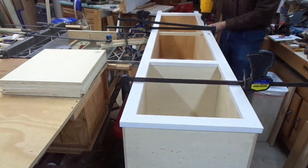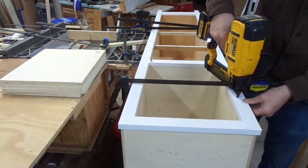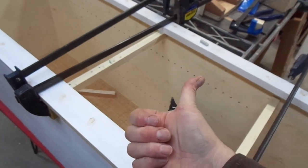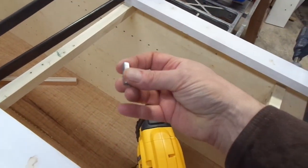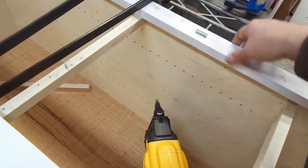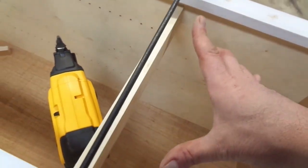So the nail holes have been filled. In this area of the cabinet, I wanted to slide the carcass away from the camera or push the face frame toward the camera. And I have a little quarter inch setup guide that I use for reference on the far side. And the technique is I have a stretcher strip in the middle that's holding the two sides of the cabinet at a fixed distance.